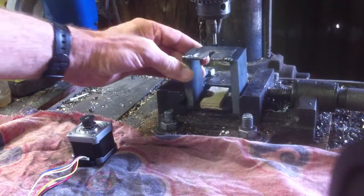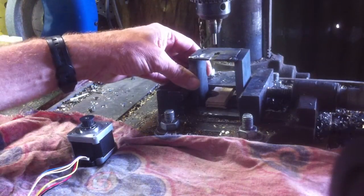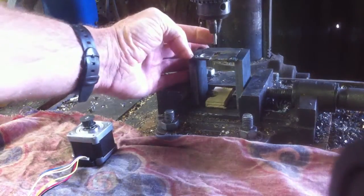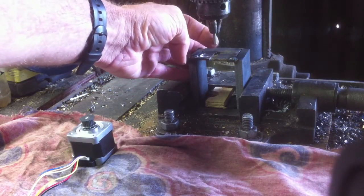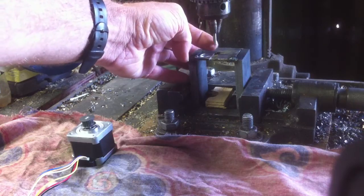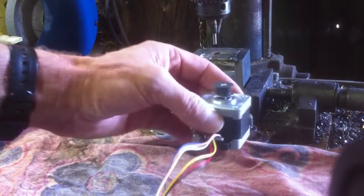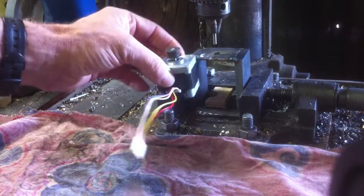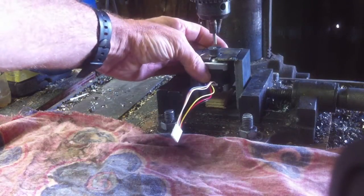With that, it's mounted in the drill press — clamp it on. In the drill I've mounted a 4.5mm drill bit and used it upside down so it's got the strongest bit on the bottom and is as short as possible. You only need about 10mm to press those out, so this just slots in underneath the drill bit.